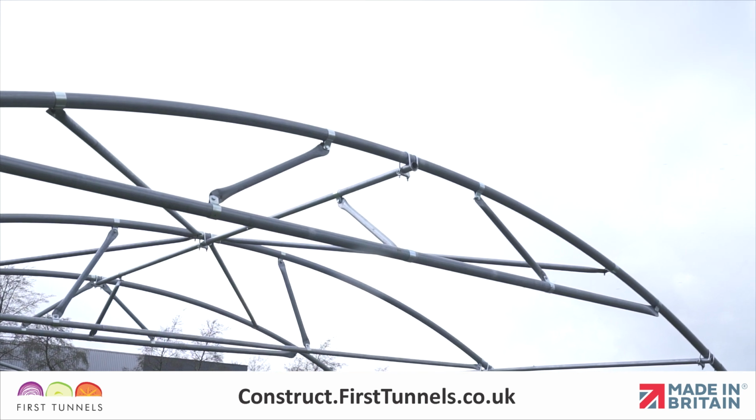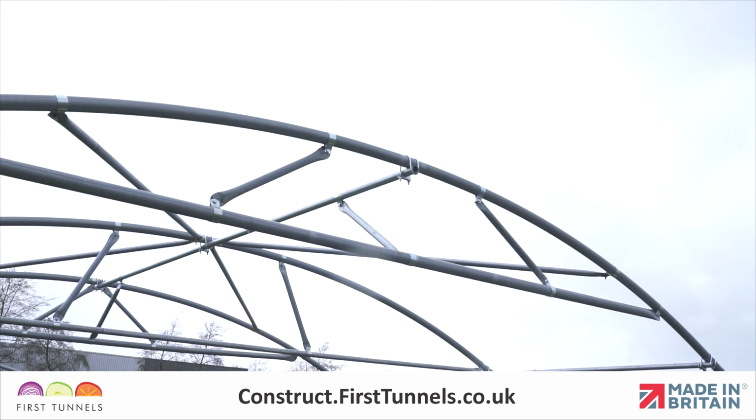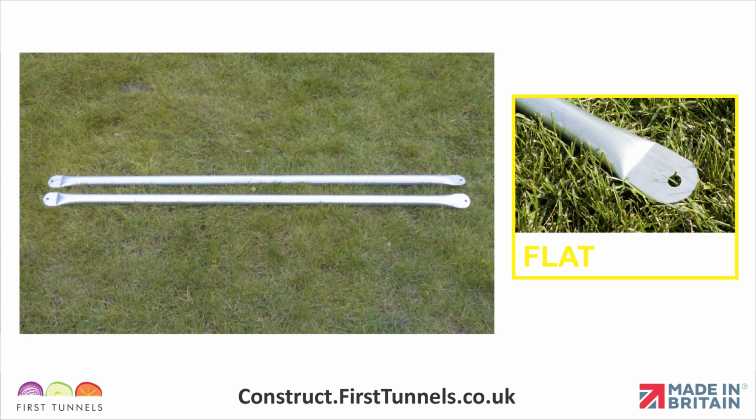Now we will fit the door rail vertical braces. Door rail vertical braces span from the door rail to the end hoop. There are 2 door rail vertical braces per end. Door rail vertical braces are 61 cm long and are flat on both ends.